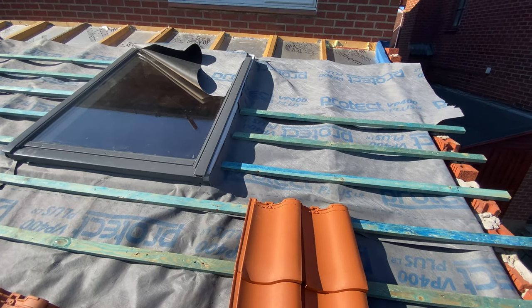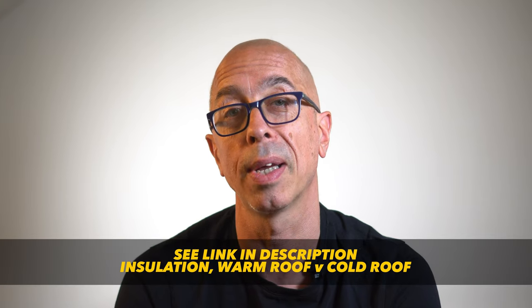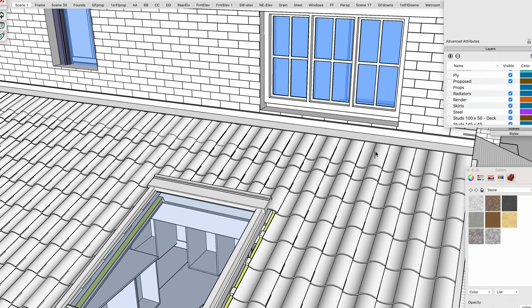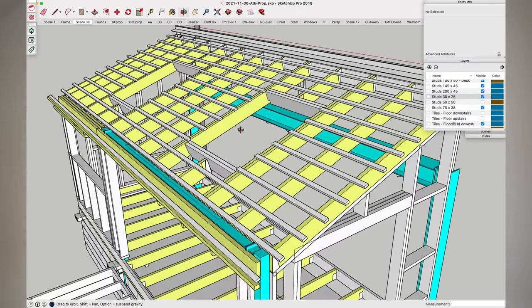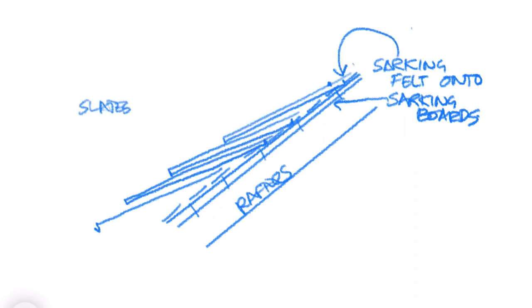In contemporary building it's the roofing membrane sitting underneath the tiles or slates that provides the water barrier, the air tightness, and the breathability of the roof — sometimes in conjunction with a vapour barrier. There are other things to consider such as vapour control and insulation; check out my other video to get your head around these concepts. Since we've chosen these clay pan tiles, our substrata will be roofing battens with a breathable roofing membrane laid underneath to catch any water blown through the tiles. If we were using traditional slates we might use sarking boards to create the roofing deck with a breathable sarking felt over, nailing the slates directly into the sarking board.